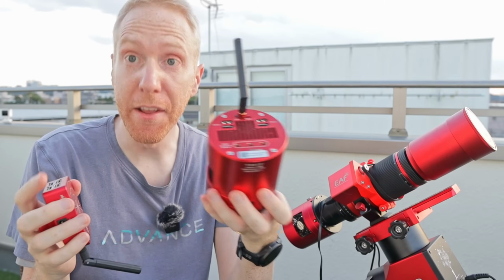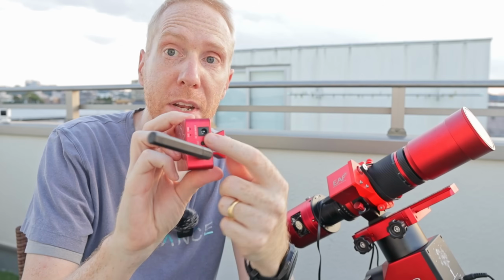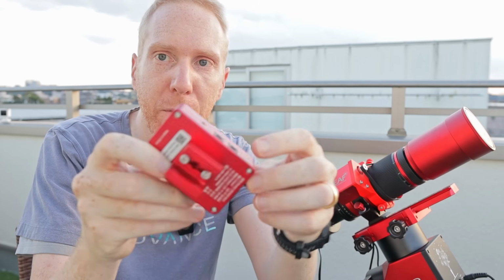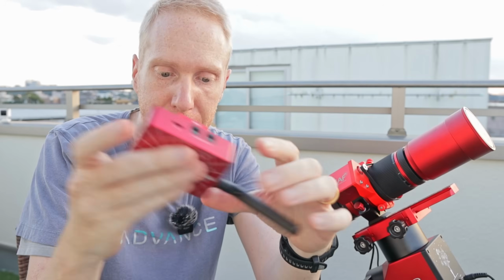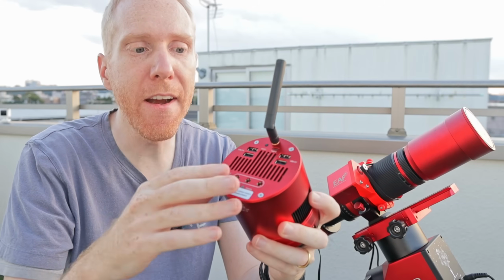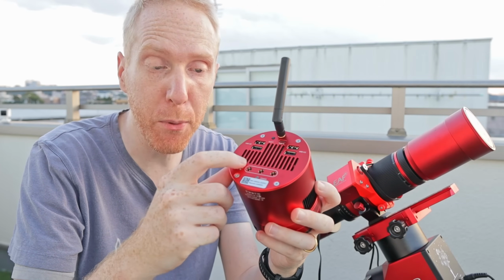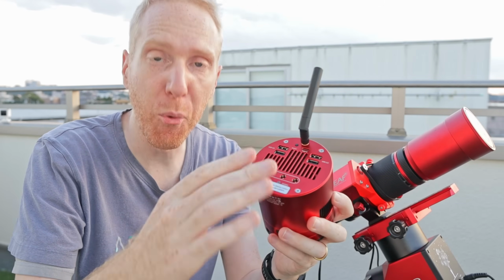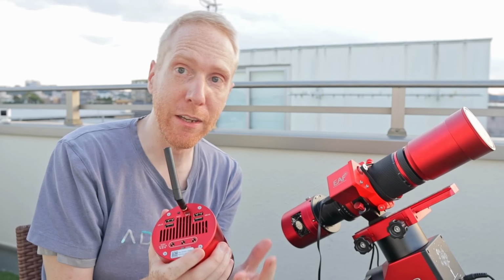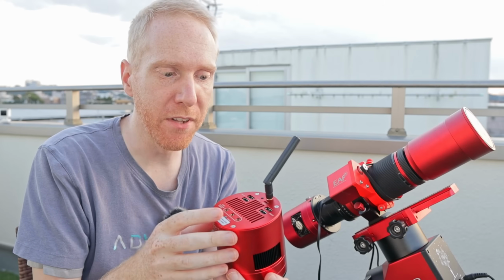The hardware inside, as far as I understand, is the same in both. But the ASI Air Mini has one DC input and 4 DC outputs, 2 on each side. Whereas the ZWO ASI2600MC Air only has 3 DC ports, of which one will be used for input and the rest become output. So we have only 2 outputs compared to 4, but then because everything is a single camera body, it's likely that you do not need that many outputs anyway.